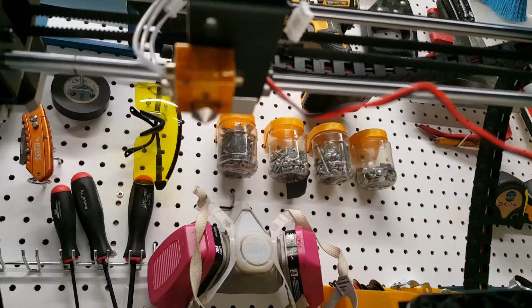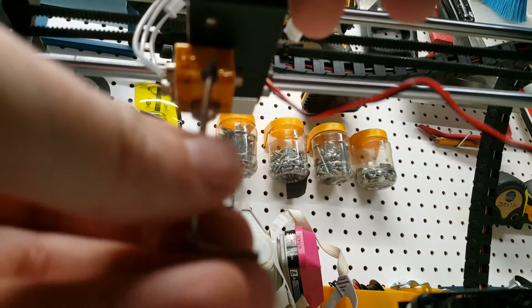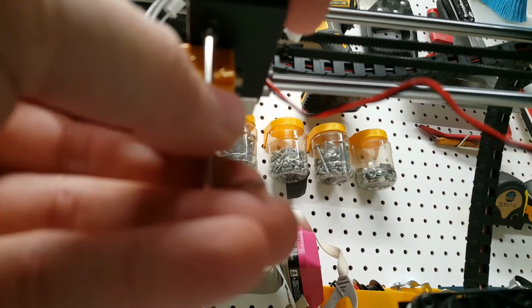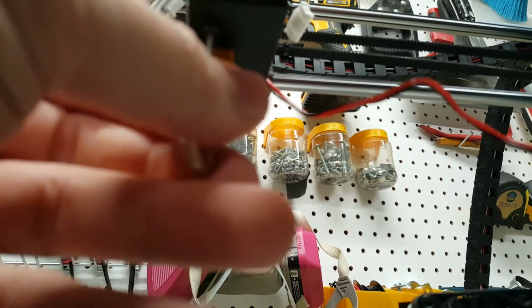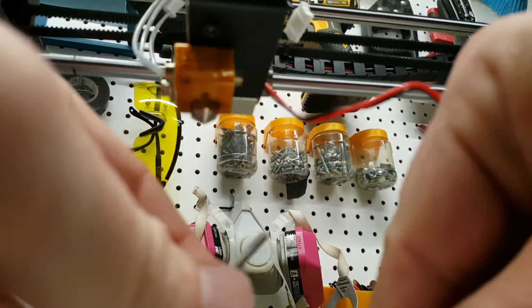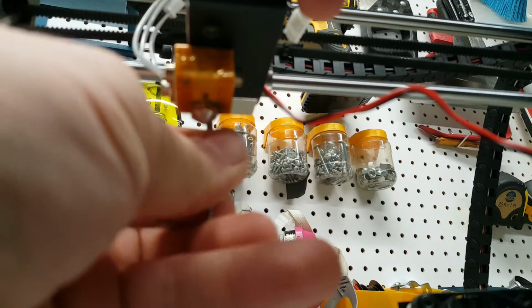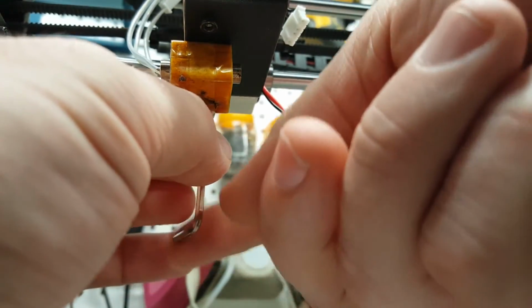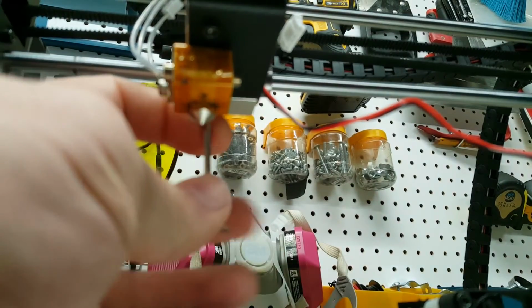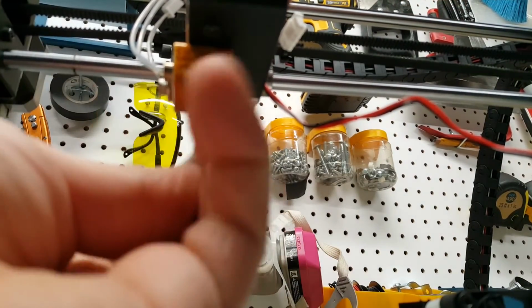And now we're going to get a better angle. Now we're going to go ahead and mount the cooling block back onto the extruder arm here. Just kind of get those two little screws that you took out in the last step. And carefully pop those back in. And it feels backwards since we're upside down here. And of course, anytime you're working with aluminum, you just want to make sure you're not cross-threaded. So you want to back it out just a little bit and then tighten it down. You never want to torque hard on this.